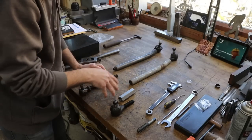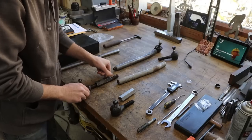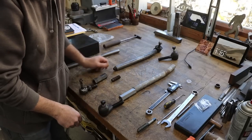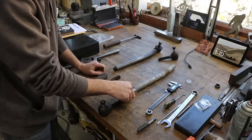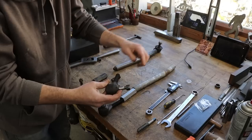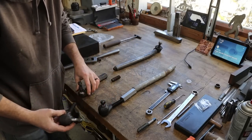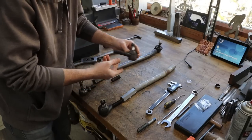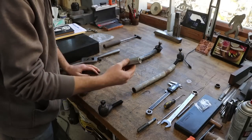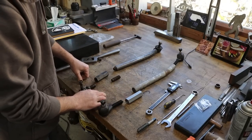And I've already got started. You can see I've got some of the parts here: a bent section of pipe, two tie rod ends that are the wrong size. What we've been asked to do is repair the old one and make a new one. So that's what we're going to do. We've got to make a new nut, and I'll explain why in just a second. There's a lot going on here. Then we have to machine our taper on our ball joints so it's the same starting size as our original. Both of them are 7-degree tapers, but these are bigger than the original. So to make sure that they work, and that when I ship this to Alaska it bolts right on, we've got to modify these tapers. So there's a lot going on. Let's get started by simply making one of these large adjustable nuts. I'll explain why as we're doing it.